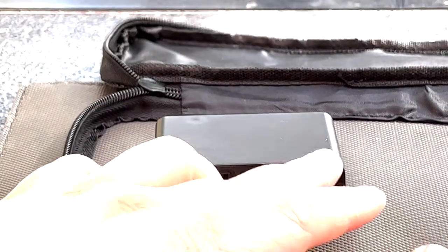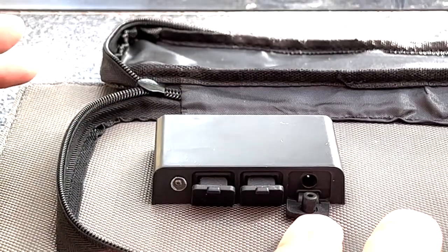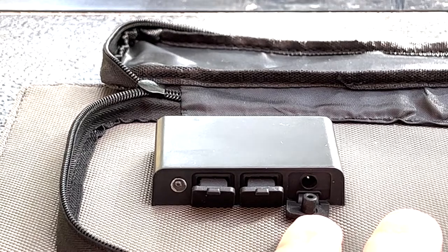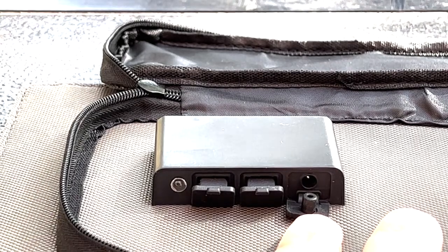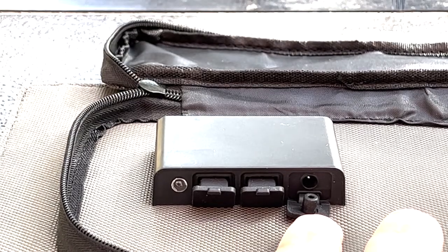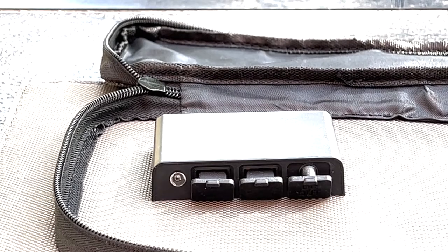On the right we have the 18-volt nominal output — when the sun hits the panels and the panel is charging, you need the voltage above 12 volts. For example, lithium iron phosphate nominal charging voltage is 14.4 volts, so you need something above that. The solar panel outputs 18 volts nominal for a maximum of 40 watts.